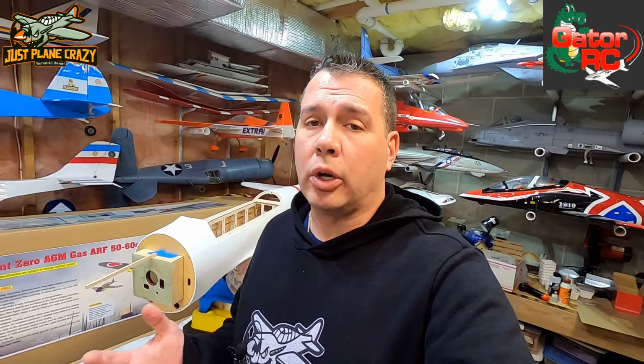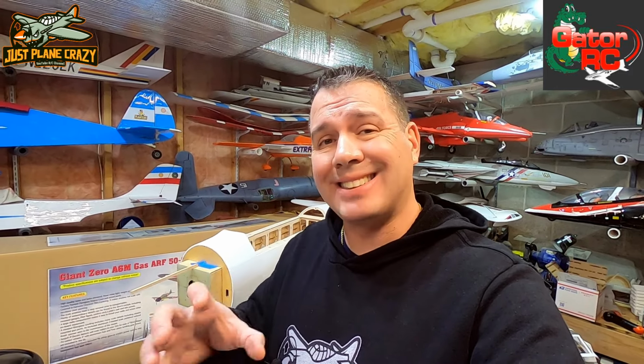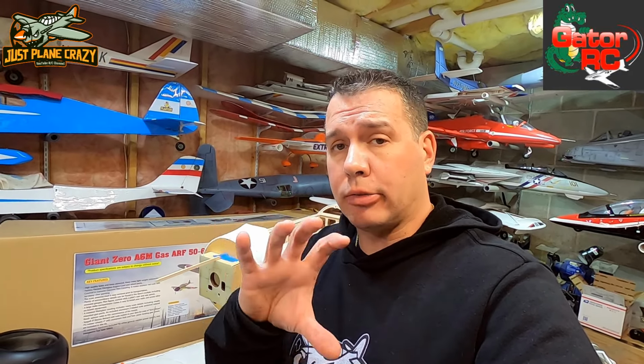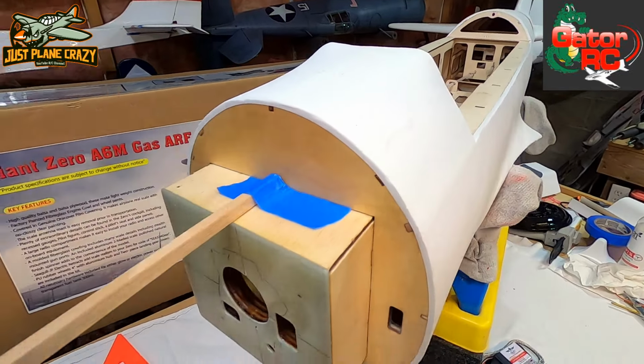Now there's a couple ways to go about installing this engine. Number one, you could check the link in my other ARF build in which I used the steps method in order to place and center the engine in the cowl. The other method is what we are going to use here, and this on the Seagull's model. On the firewall, they actually have it marked off for your down and right thrust, and you could see the difference in the firewall box right there.